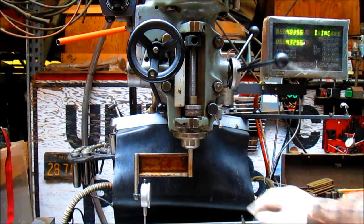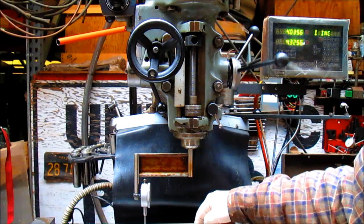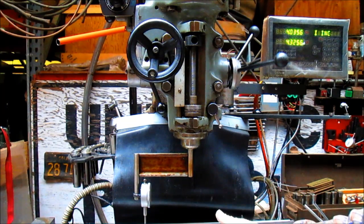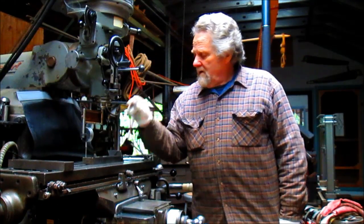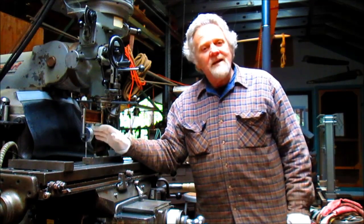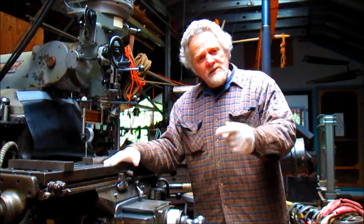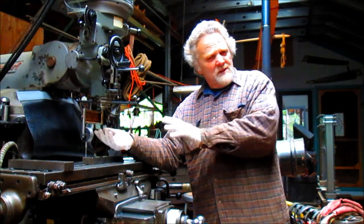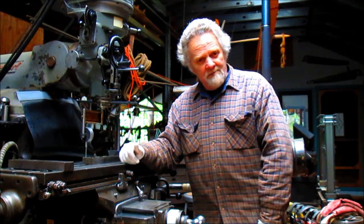So we've got a totally trammed head. Now any hole that we drill is going to be absolutely perfect, accurate, straight down the center — which is what we have to do next, is drill a hole. We've got our head trammed in, we're all set to go. We're going to come in, drill a hole and then bore it, so everything needs to be square to do that. Thanks for watching. Subscribe — we have fun here. This was a little bit more serious one, but we're constantly goofing off and having a great time. This is Nick Collier, signing out. Thank you.